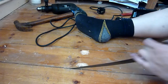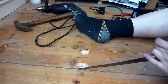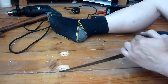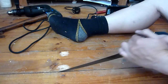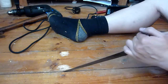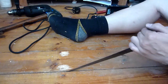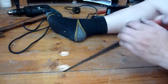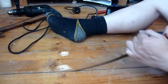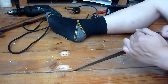Guys, you gotta get your tools. I'm just going to cut the surface of this. Such a shallow angle, I'm just going to cut the surface. I know there's got to be a main beam underneath. Just going to weaken it. Might not even bother cutting through. Yeah, this is going to work. Makes sense. Whereas the electrical saw would have gone straight up and down, buzzed through the main support beam, which is not good. This way I can feel for anything like metal pipes, anything like that, have enough time to react to the air. That's perfect. So this is going to work.